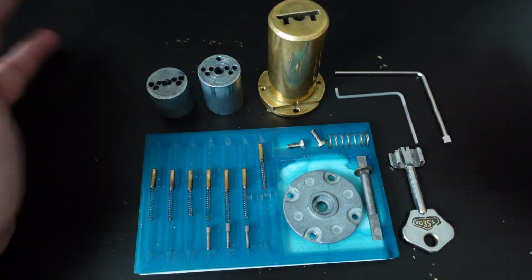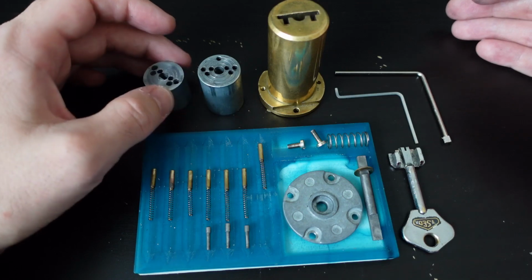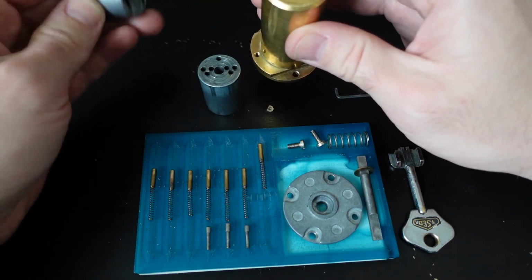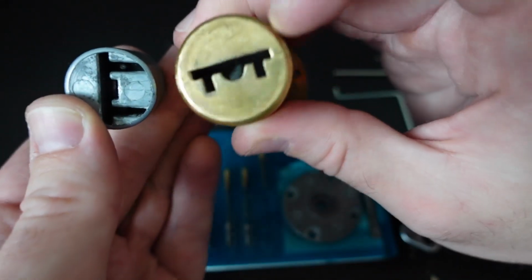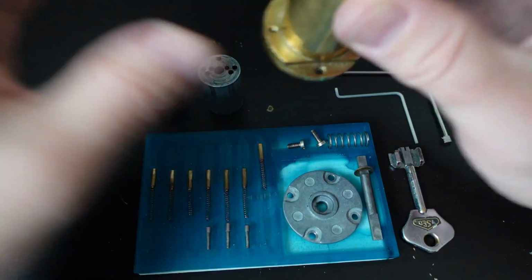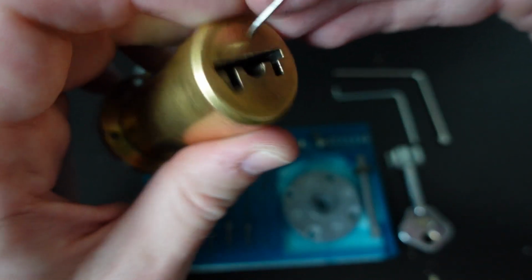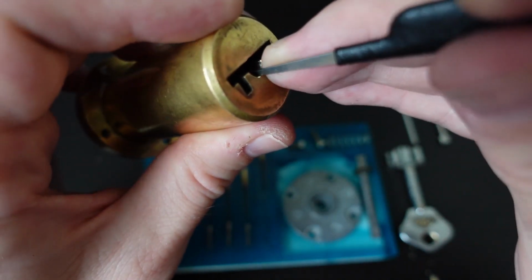So what's this about? Basically what I did is that I let the trap pin engage, and so the core stopped its rotation at 90 degrees, so it was like this, right? Or actually rather like this. What I saw was, of course, the housing, and behind it I had this. One thing that is important is that this housing is not thin, this face is not thin, the metal goes a bit further, right? So this is actually pretty thick. In order to reach the trap pin, you have to go inside with some tool.